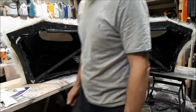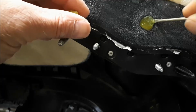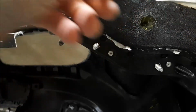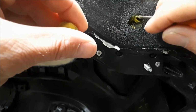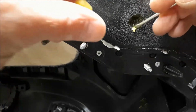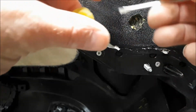This is interesting. Should I bring you back when I've got something interesting to show you? This is a bit interesting. So those little bits of filleting wax that I put in, to give us a lock. You can see that. So instead of, like I said, relying on the bolts and nuts to hold it in the right place, we've now got a nice little divot. That's a good word. That will lock the mould in place, and the bolts just clamp it all.